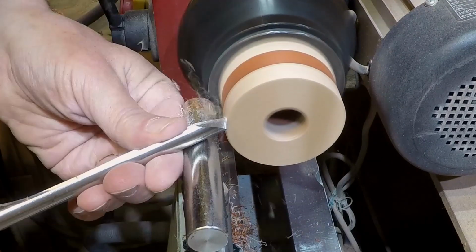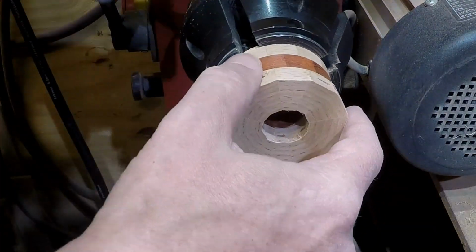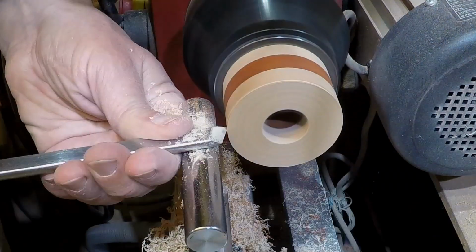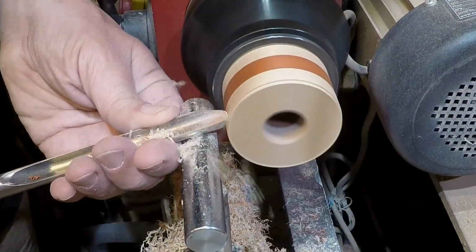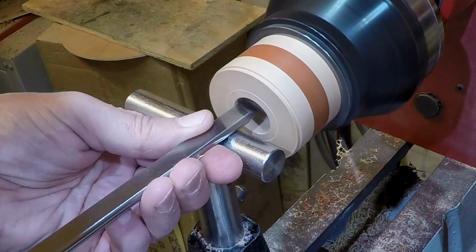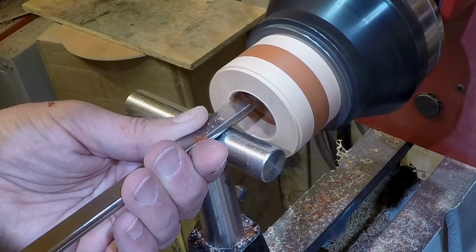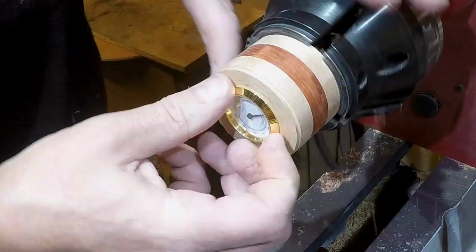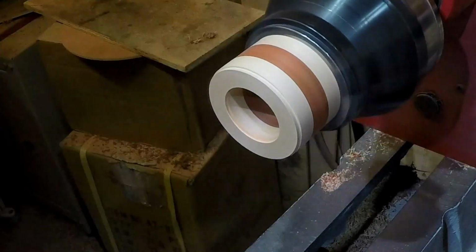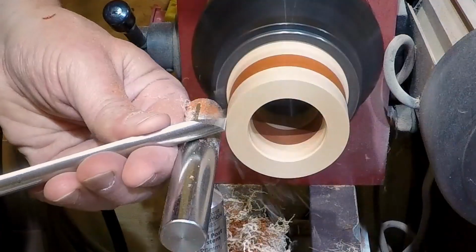I've then switched over to my O'Donnell jaws, as this moves all the work further away from the chuck, and I've created a tenon on both ends. The outside is then trued up before the inside is then hollowed out to fit the extra gauges. After the inside has been sanded, the outside is then taken down to the required size and then sanded up through the grits again.